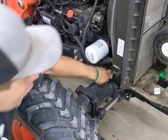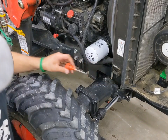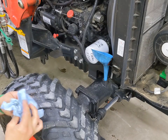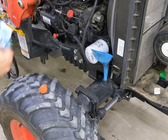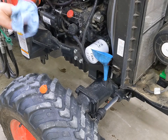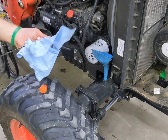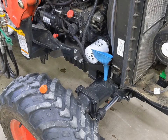I started it up — the oil pressure light did come on for about five seconds or so and then went right off, so that's a good sign. I'm going to put the DEF funnel in there — it seems to do a good job for transmissions. Let's check our engine dipstick first because that's the most important one. We are right there just slightly below the full mark — that looks perfect.